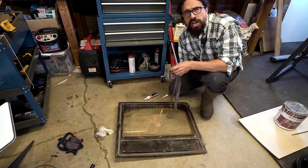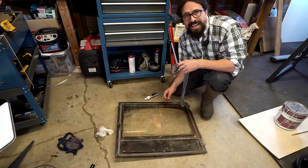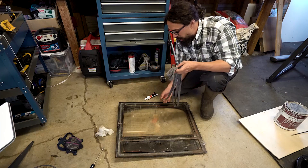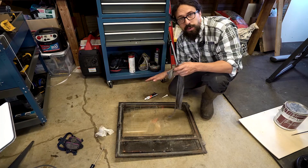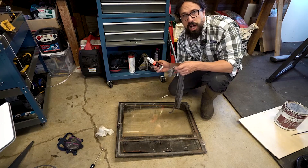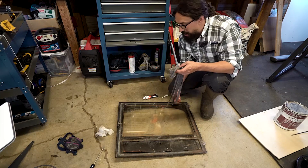They have a lot of different sizes. For most people, the round rope is going to work better for your doors if it has a groove like this. Because of how my door is closing, I wanted to try a flat rope. But like I said, they have all types. You do want to measure and see what's going to work best for you. The gasket glue will hold up to 2,000 degrees, so higher than most stoves or fireplaces are ever going to get.